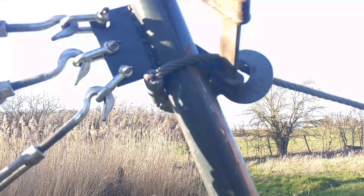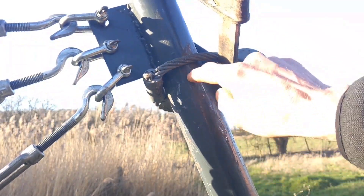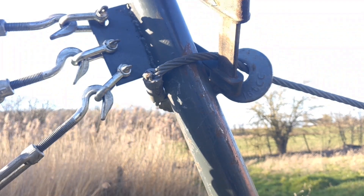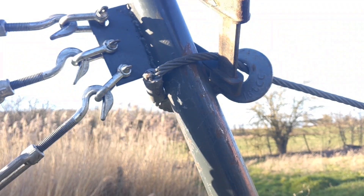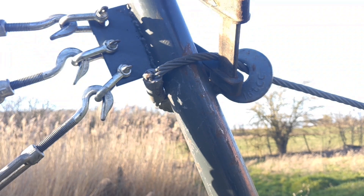So my brothers, to make sure we don't have a disaster like that again — because that's happened twice — I'm going to weld something on here which will stop this going down. As I explained, the gin pole is at too low an angle. It needs sorting out eventually, so let's get that on there.